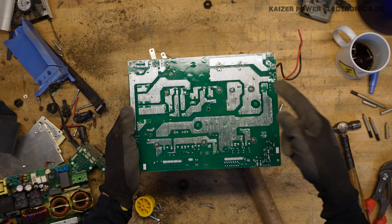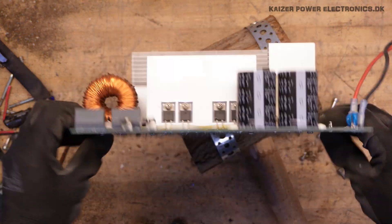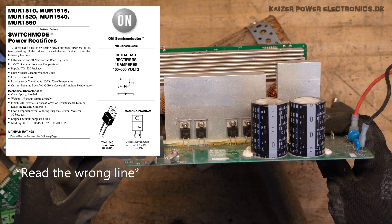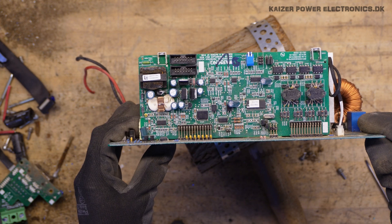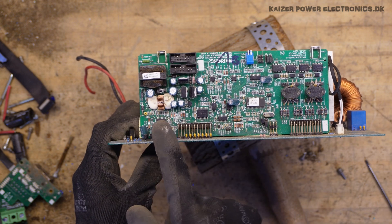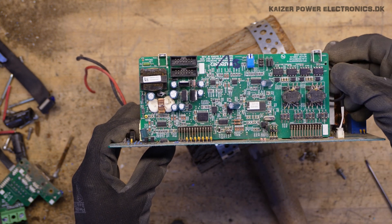We have our DC link input here going to the two DC bulk capacitors, and we can see it goes up to the first heatsink here, with another on the other side. So here we have a row of four diodes — these are HF0306, so something like 600 volt, 30 amp. On the other side we have a control board stamped 2009 in the corner. It's running on some kind of smaller microcontroller with a crystal next to it — something like 7-point-something megahertz. We have a small housekeeping power supply and some isolated power supplies for the gate drive, plus what are most likely optocouplers or gate driver ICs.